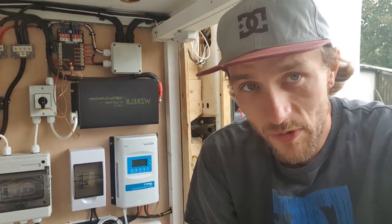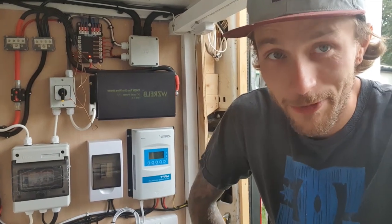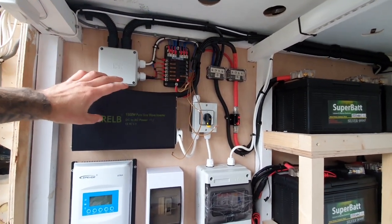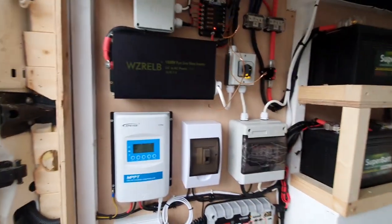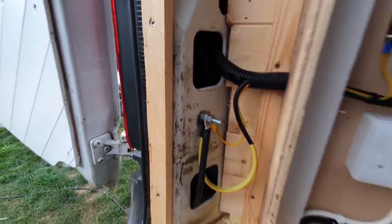I got completely carried away with wiring again and didn't do any filming — I ran a few time-lapses but I don't know what they're on. I pretty much bottomed out the bulk of the electrical work, so this will actually be the last electrical vlog. It's been a few days since the time-lapses. The main junction box is now together — I'm not proud of the wiring, I might pull it apart and tidy it up another time. I've run a 25 mil single-core earth down and bonded it to the body of the van so the batteries are now earthed to the van body.